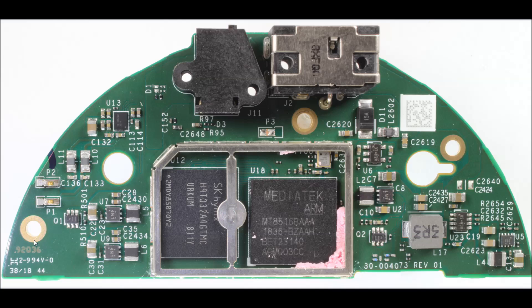The outline of this mounting hole is golden in color because the surface finish of the circuit board is electroless nickel immersion gold — it's a good finish and solder wants to flow to it very rapidly. There are two connectors, P1 and P2, for the audio going to the speaker. The left-hand side of the circuit board is basically the audio section and the right-hand side is the power section. A good hint for finding the power section is to look for a big inductor, or look for a small 6-to-8-pin device next to an inductor and a capacitor — this is basically a buck voltage regulator taking a high voltage down to a low voltage, and we can see that repeated four times.